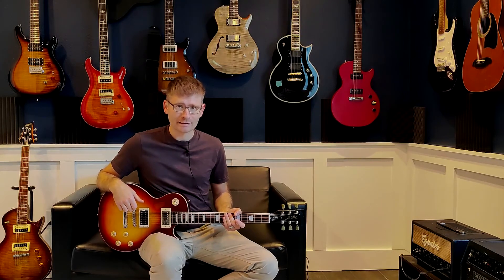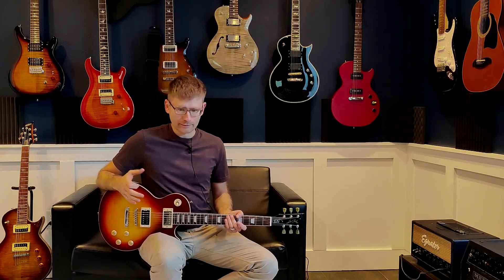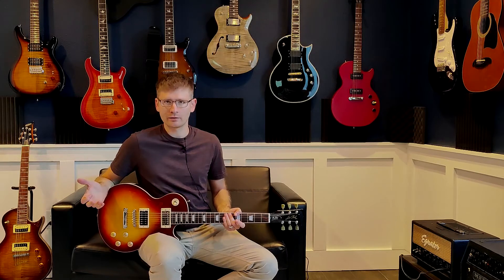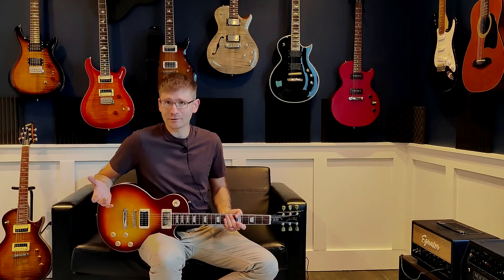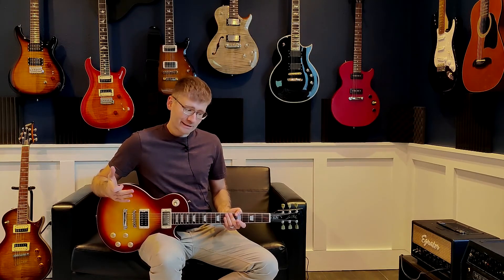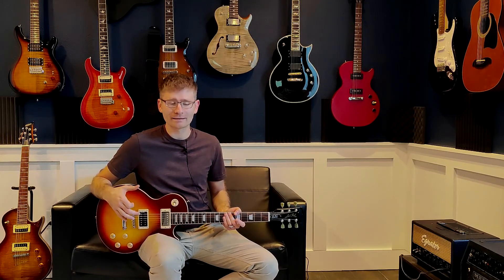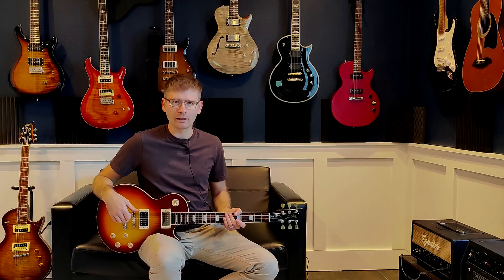All right, so that finishes up the audio test. I think I could hear a little bit of a difference between the one-foot cable and the longer cable with the most capacitance. Obviously you can't really do a show with a one-foot cable — people might think you're a little bit goofy, or just really hardcore about your sound. But the buffer pedal definitely made a huge difference. I could absolutely hear a difference there, no doubt. So I would say it's probably worth having a buffer pedal in your signal chain.